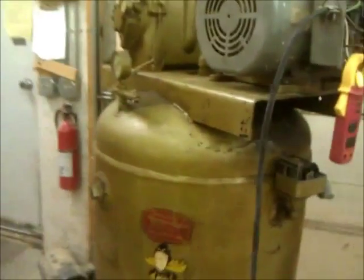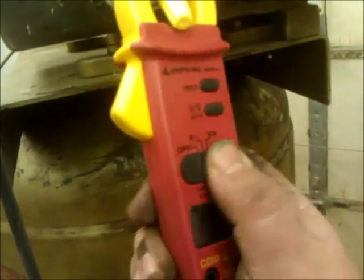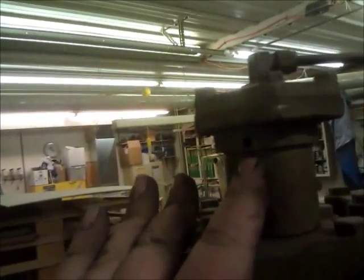I also have an amp meter on there as well. The one thing I did notice during initial testing while building pressure is up on the unloader tower where it bleeds off the excess air — it was leaking ever so slightly. It used to bleed quite a bit at first, but now you can just barely feel it. I also replaced the air filter; it looked like it was past time.